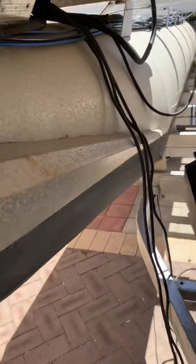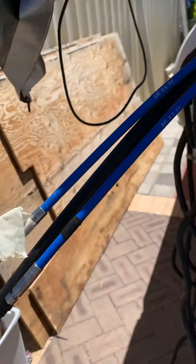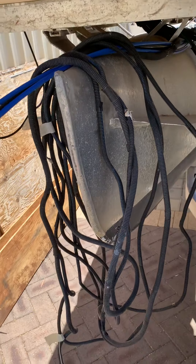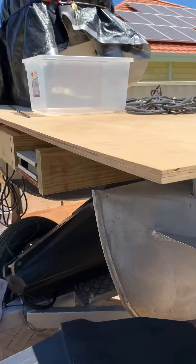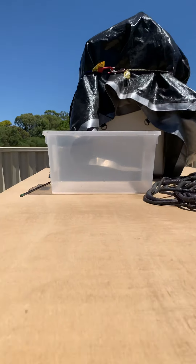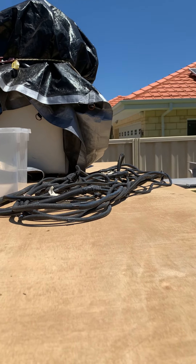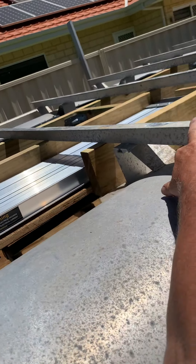I've got my steering cables and control cables up the front, along with nav lights, some speakers, and spotlights wires for both sides. I put the steering console right up the front — 200 mils back from the end of the boat, 500 mils — and the driver's seat will be sitting 200 mils behind that, then through to the fourth rail where the cabin actually starts.